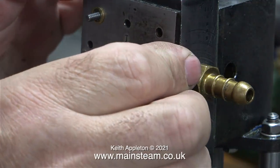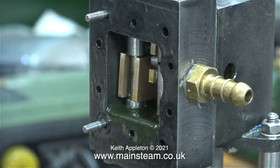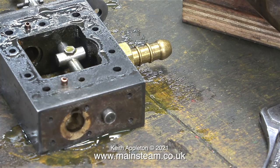I removed all these parts very carefully because I want to preserve the state of the positions of the valves in the steam chest, and I can immediately see that the main shuttle piston valve is not in a very good position. I machined it as per the drawing, but I don't think the shuttle valve is 100% as per the drawing. The problem, as far as I can see, is there's too much play between the quarter-inch diameter centre part of the shuttle piston and the slide valve.